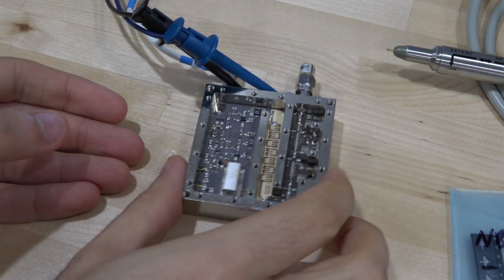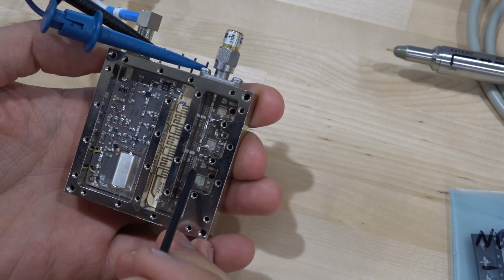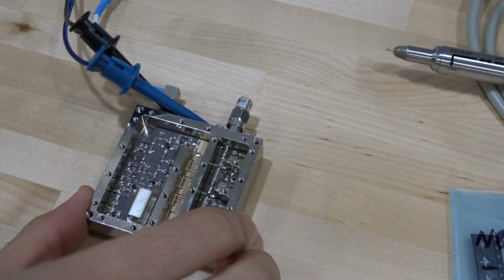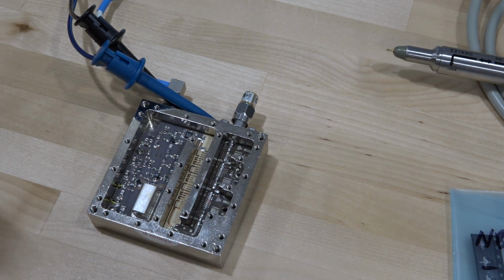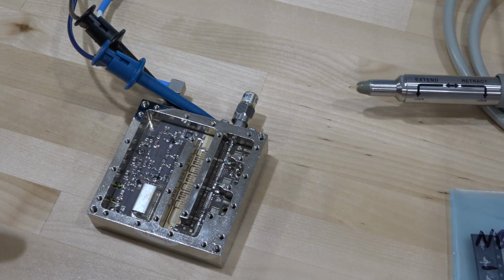So I went ahead and removed that amplifier, the final stage amplifier, just to see what happens and to replace it. And I just also realized one other thing. I was making an error before. I had forgotten that I had my 10-to-1 attenuator at the output of my active probe while I was doing those measurements. So that's why some of those numbers were much smaller than we would have expected them to be. So the numbers are now correct.